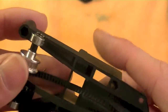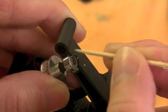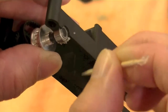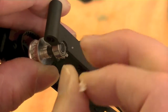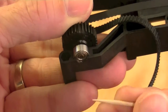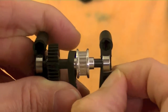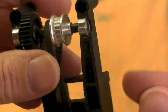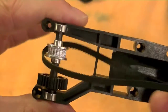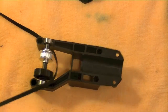I just want to tack it down. Just going to slip that on, just like that. Make sure you don't have any excess goop getting into your bearing. I got a little bit on the edge there that I'm just going to knock out. This stuff when it hardens, hardens kind of like a rubber — it's not like thread lock that will lock it down hard. But that rubbery coating will help lock that bearing in place. So I've got that there. Remember, your belt should be on here by now. If you don't have your belt, you should probably think about that before we continue. I probably spent way too much time talking about that, but I see a lot of videos where people talk about putting goop on but they don't actually show you how to do it. So that's how I do it — if that's a method that works for you, use it.